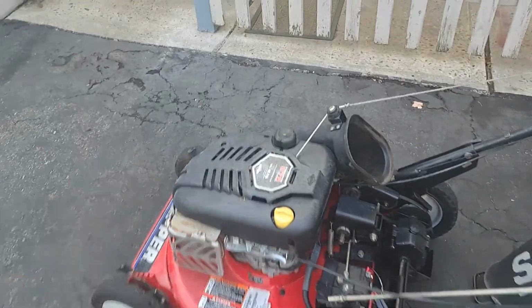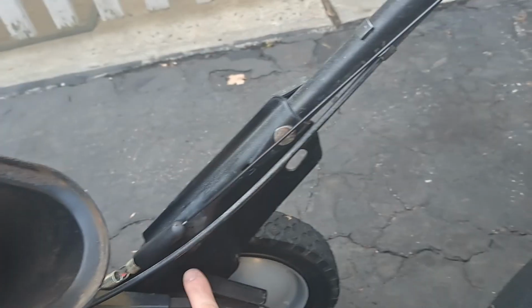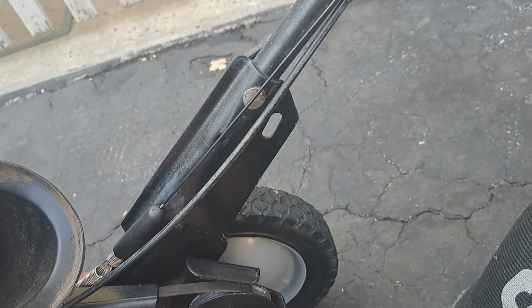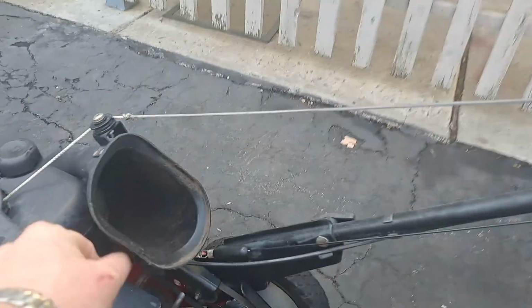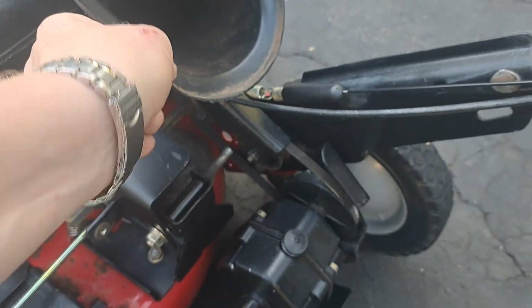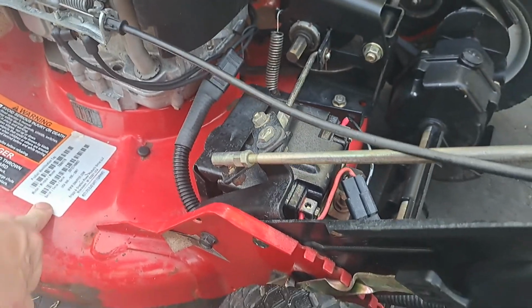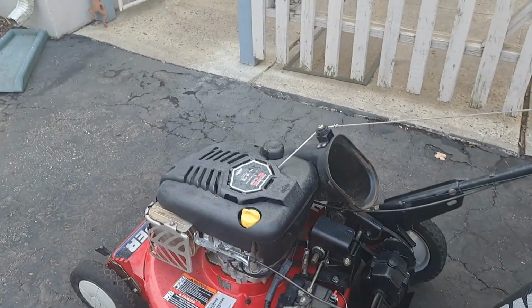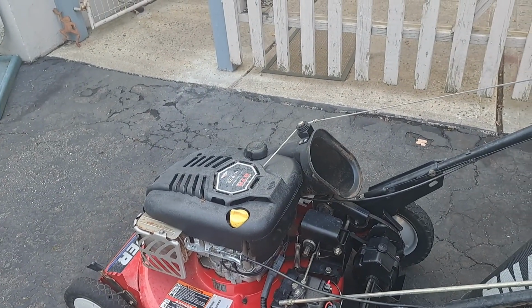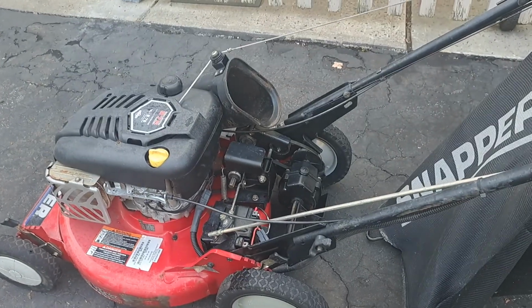On a snowblower, it's one belt, not two. They have this transferring a belt from this metal plate to the rubber wheel to another belt to the transmission. This can even be filled up with grease. But this system has been around on these Snappers for a very, very long time. I've had one that had to have been an early 70s model, probably early to mid 70s. It was definitely old. It had the white engine. It was a 3.5 horse. But that system's been around a very long time, and it's still around. So these are good Snappers.